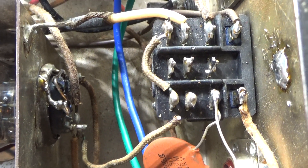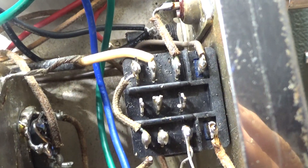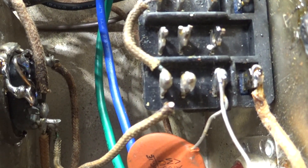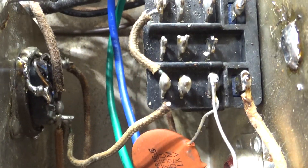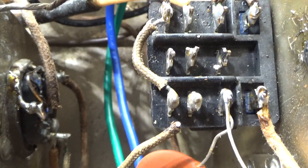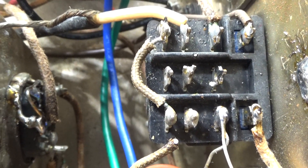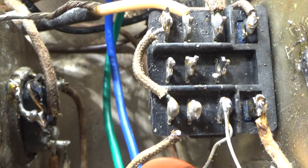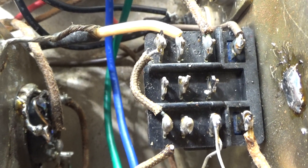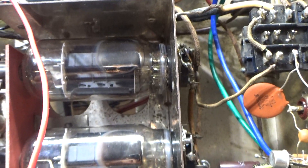A very common problem with amps that aren't doing anything — where the tubes aren't getting hot and it's not pulling any amps — is the input somewhere not getting into the tubes. A dirty relay causes that problem too. When you're dealing with 40, 50, 60-year-old amps, the relay is often dirty and carboned over, causing the same problem. So always check your input SWR if you're getting no watts at all. Hopefully soon we'll have it up and going and we'll make another video.